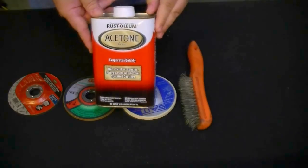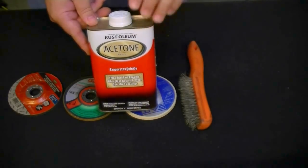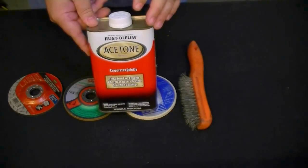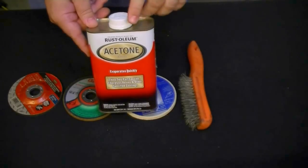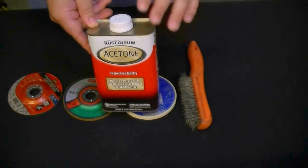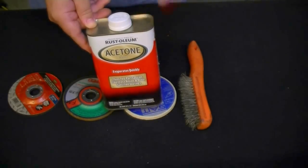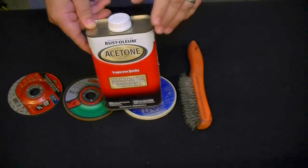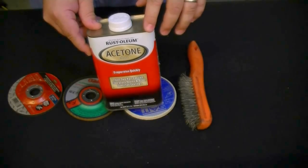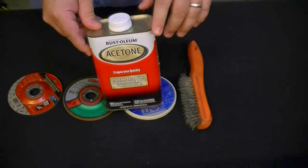The last thing here is acetone. Acetone is actually a recommended solvent for cleaning aluminum. All your aluminum that you're going to get has some kind of film or coating on it, so before you start working with aluminum you want to take acetone and, after you've ground it and done everything you're going to do to it, take a rag and wipe it down with acetone. Use gloves and common sense when handling acetone because it is an organic solvent — the vapors can be harmful and it can soak into your skin pretty quickly. If you're not going to use acetone, be sure to use a specified aluminum cleaner. And never, ever use brake cleaner or any chlorinated solvent.